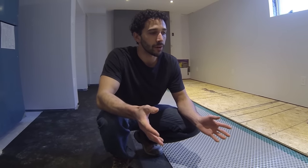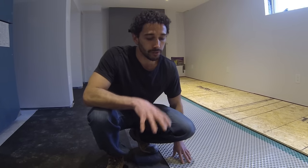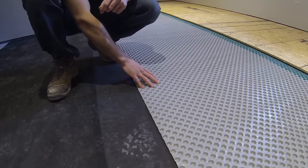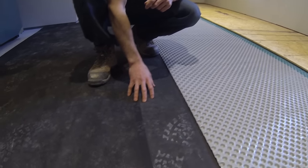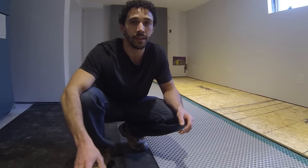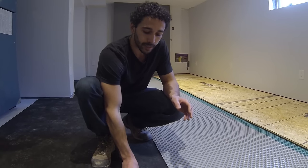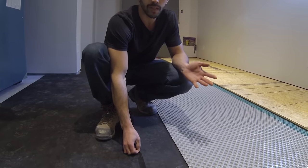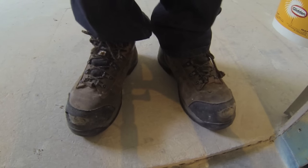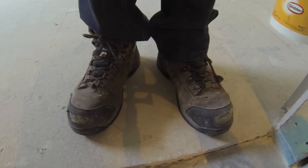The great thing about having a subfloor is you never want to have wood directly on concrete, and you also want your floor to be able to breathe. This is a poly product, it's not going to mold. The first thing you want to do is make sure your concrete floor is clean and free of any organic materials because organic materials will mold. Vacuum everything. Most basement floors aren't level, so if you do not put the landscaping fabric down you'll get a hollow sound. I was the guinea pig and tried installing a portion of this floor without any cloth underneath, and you can hear it here.